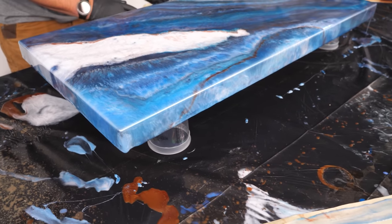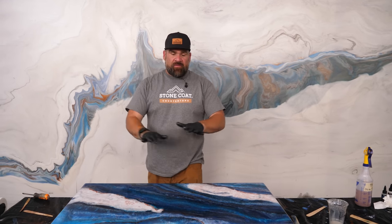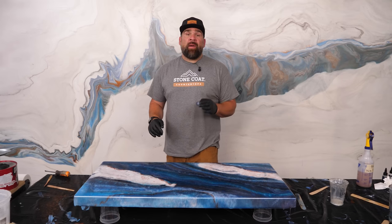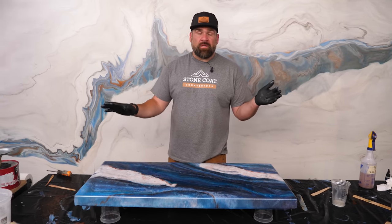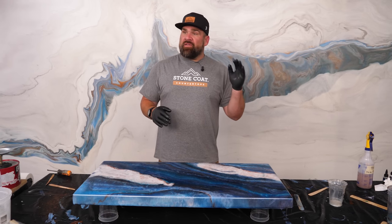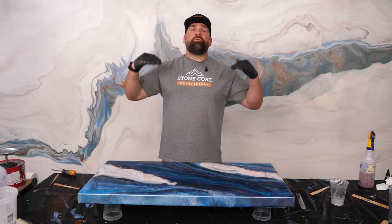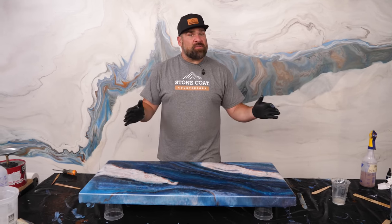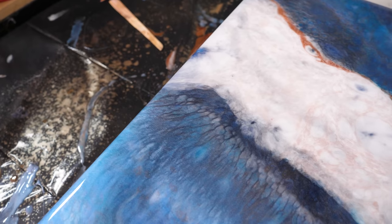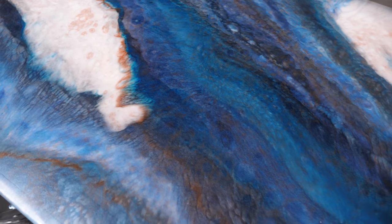I'm pumped — this looks very pretty. I'm going to throw away my tape and walk away. Turning off the lights and the AC gives you the cleanest finish overall — the bugs come to the reflection and the AC spits lint. I'll be back tomorrow to do a clear coat, so I'm not that worried about lint or bugs. I'll sand those out, apply my clear coat, let that dry, then apply the top coat. That is our three-part epoxy countertop system: your color coat, your clear coat, and then the ultimate top coat for maximum durability. It brings the sheen level down to a more natural look and gives you the longest-lasting countertop that replicates mother nature and granite. This is some Van Gogh granite if I've ever seen it, and it cost me only a little bit over 50 bucks to make this piece.